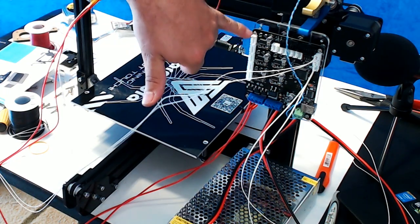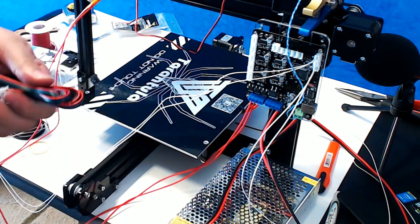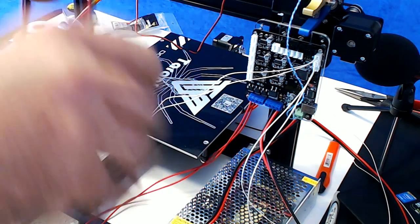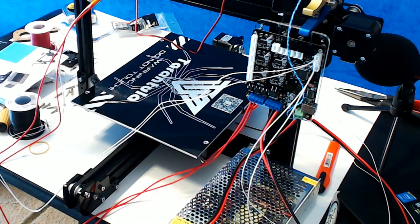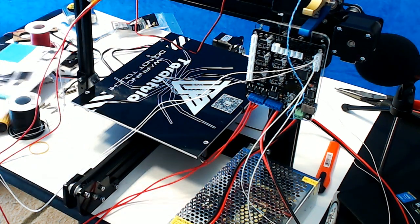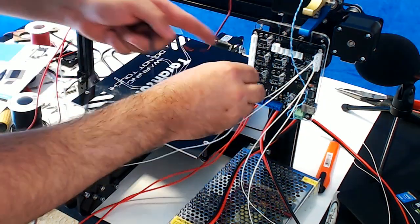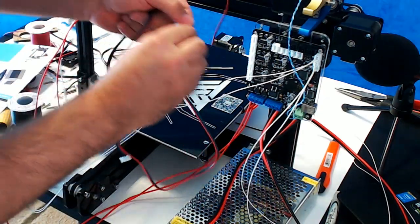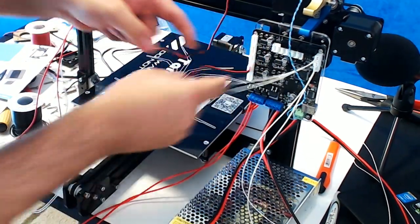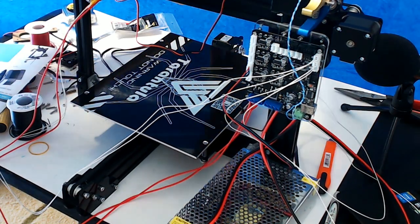We have all of our motor plugs over here. You should see a package of cables — there should be four cables, one for each motor, in different lengths. The first long one is probably going to go back around to your Y motor — the Y motor is right there. A few of these you'll want to plug in now, and they only plug in one way, so if it's not fitting then you have the motor end in your hand. This one wraps around here and plugs under the motor back here — this is our Y motor.